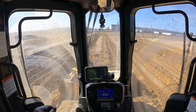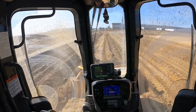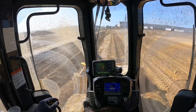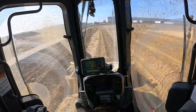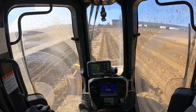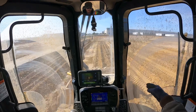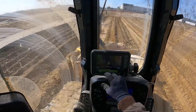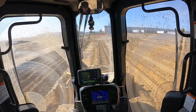And this is a parking lot, which means that parking lots have islands where it's like a green area — they'll plant a tree or something in there. And since I'm on this far left edge of the parking lot, these are where I would run into some islands. So I'm more towards the middle, towards the end of the islands where they only come out towards the middle. So I changed the point for the GPS to take elevation to be on the right side of the blade. As you can see, there's an island coming up right there, but since our elevation is on the far right side of it, we are cutting at the parking lot elevation.